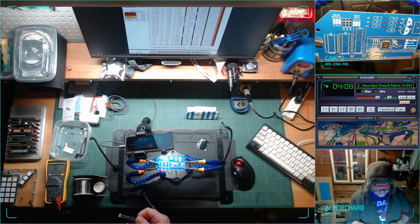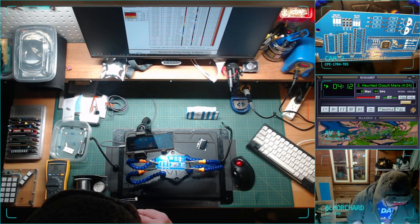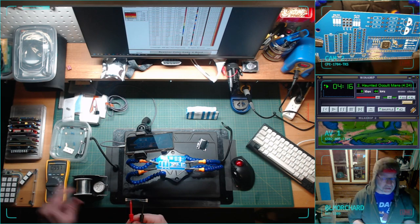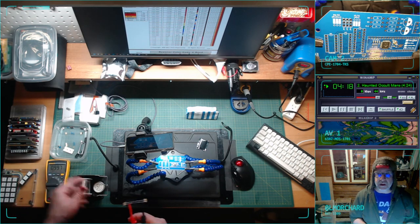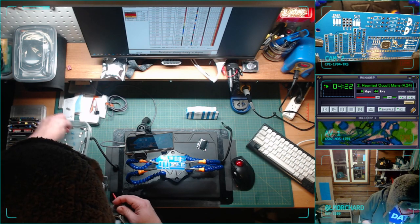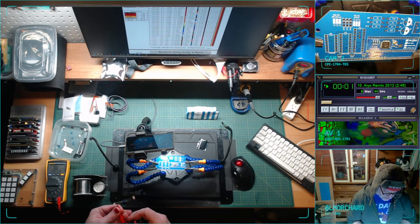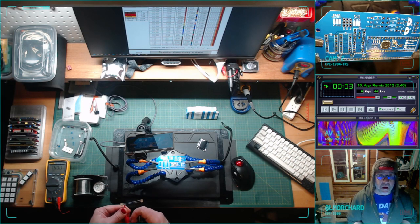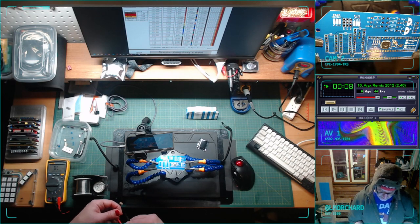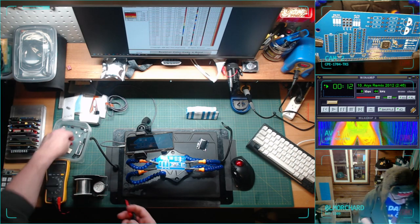Let's see. I got 2. These are probably 1K or 1K6. Okay, this is a 1K resistor. It says this is pretty close to 1K. We're gonna call that 1K, which then ideally makes this a 1K6. Survey says, yep, 1K6. Okay, cool. Well, I've kind of sussed out my parts here.